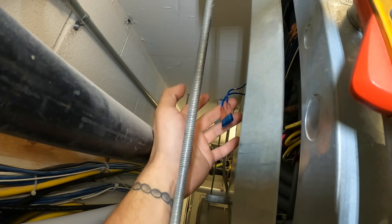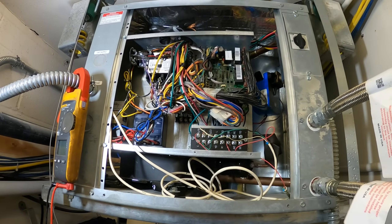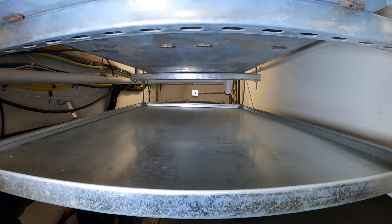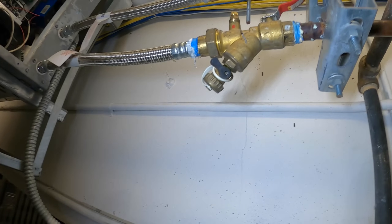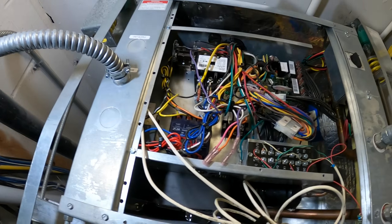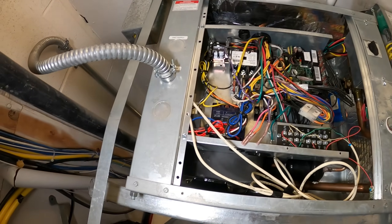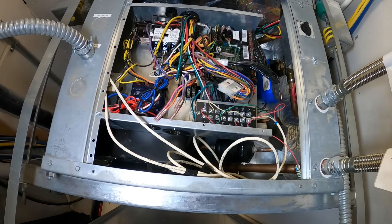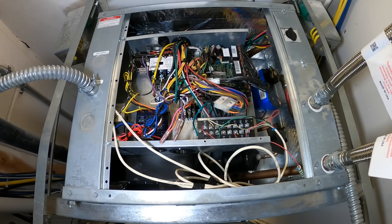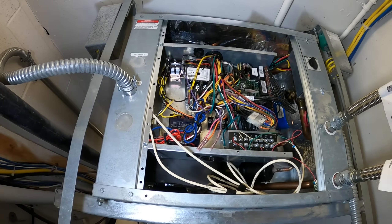We got to see what this is — what did they bypass there? Something is bypassed with this little car fuse. Unbelievable. This whole building is hacked. So we put everything back, everything's running. Cleaned the strainer, blew out the drain, changed the filter, monitored the situation, and looked into the wiring. It looks like from somewhere on this board, they bypassed the low pressure control with blue wires. Like 95% of the units I work on in this building, the high and low pressure controls are bypassed — but the pressures are actually normal.